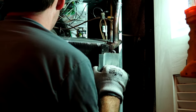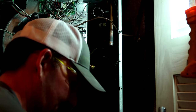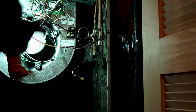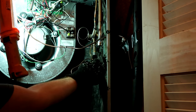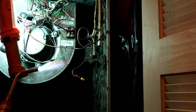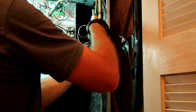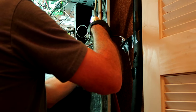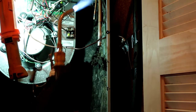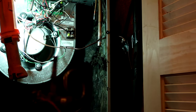I love these coils - now the good ones are glued in. That's it baby, oh it's a boy! Congratulations! Now we've got to get that old TXV out of there - the nitrogen is flowing through the TXV now down underneath the braze. Let's get that egg salad out of there. Egg salad is out. So again, would you save the TXV? There's nothing wrong with it - what do you pros do, should I keep it and use it or trash it?